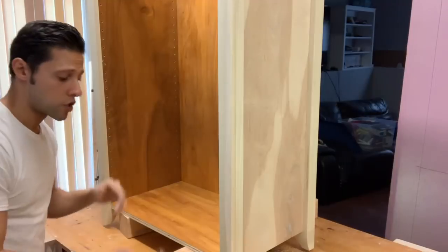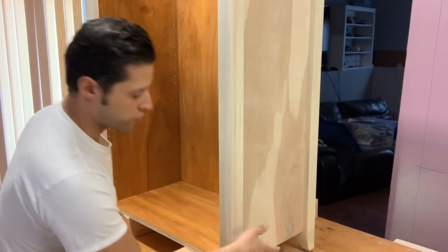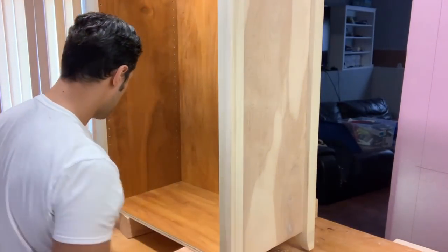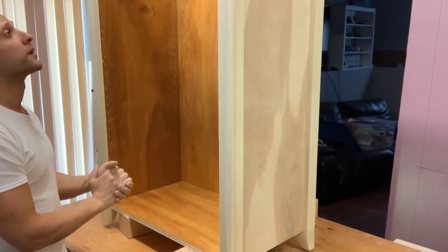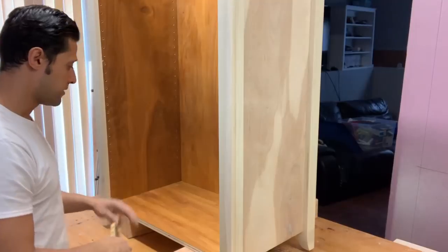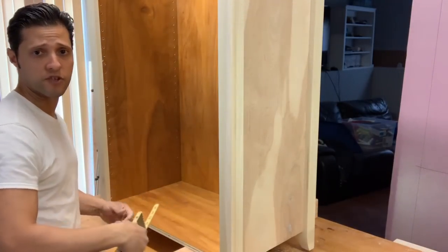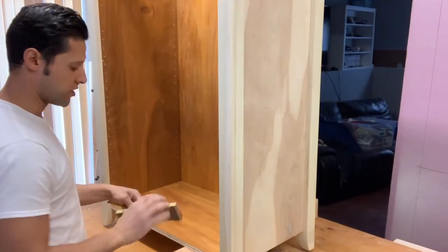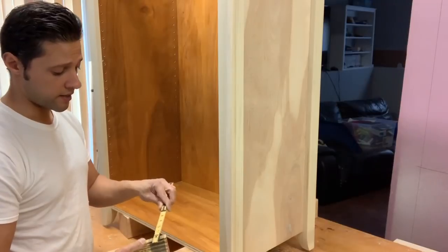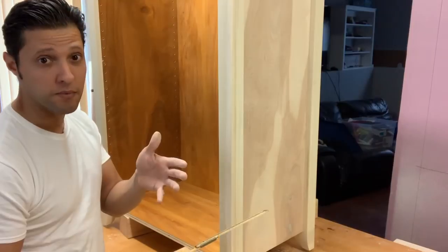Now that the carcass of the cabinet and the legs are assembled, I still have to do some trimming here on the side. We're gonna put some rails across and it's gonna match this. What I'm gonna do now is cut the adjustable shelves, but to cut the shelves I need to measure the inside. You've seen me take two sticks and put them like that, side by side clamped together, and measure the outside of the sticks to get the inside measurement. But I've got this old-school carpenter's ruler — this thing is probably my grandfather's, probably about 45 to 50 years old, maybe more.